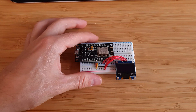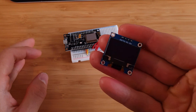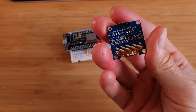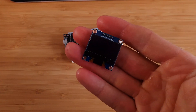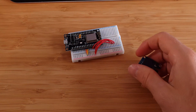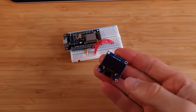Let's take a closer look at the display itself. These are 1 inch mini OLED displays and they run on the i2c protocol. The i2c protocol allows multiple devices to be used on the same two wires — each device is programmed from the factory with an address, which allows the Arduino to differentiate between them. It uses the SCL and SDA pins, which correspond to the same pins on your board, and these accept 3.3 to 5 volts — just double check your particular device matches.